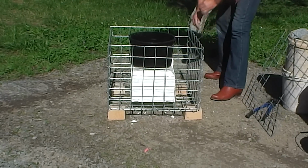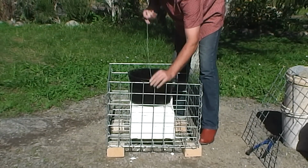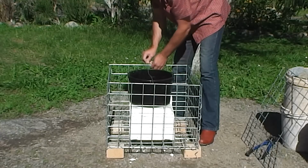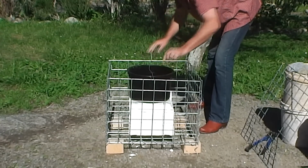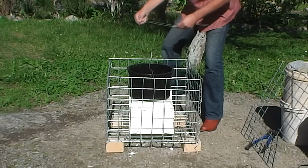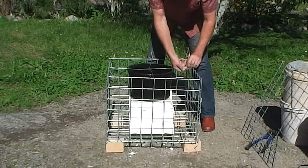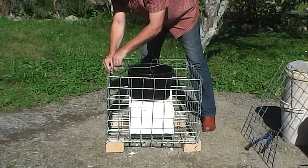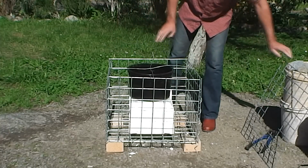So the top tip with all gabions is if you just put a temporary wire across the top, that will stop the cage blowing out. So a little brace wire across the top just keeps the whole thing true and straight, so when we go to put the lid on, it's ready. So there we have it, ready to put our rocks in.